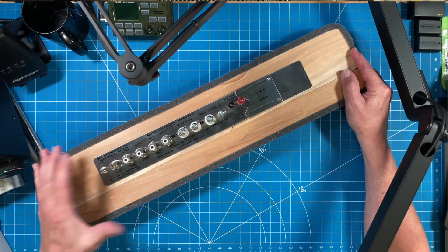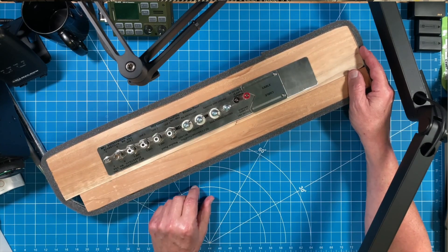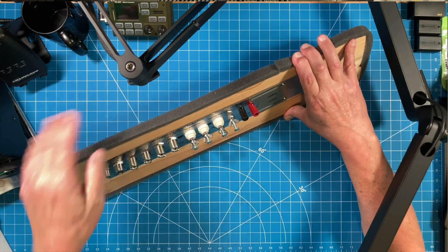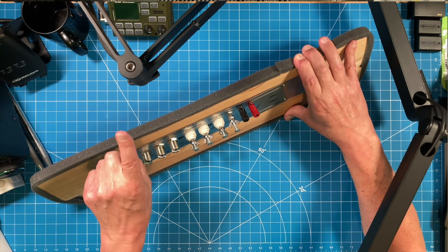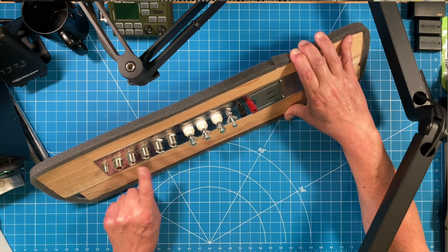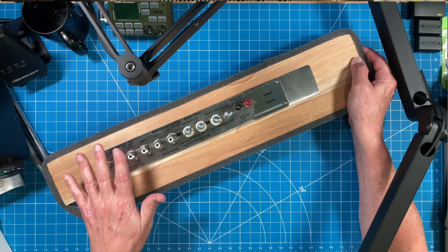This is the weather stripping that came with the MFJ kit. You might need to do some customization — you might need to get some different weather stripping or some caulking. Also, when this is outside and you've got rain beating down on it, it's possible that it could be a leak joint up at the top, and water could seep in. So after you paint, run a bead of silicone caulk right across the top and flatten it out so it looks nice. Take it down the sides, maybe even on the bottom edge, so you don't get any wicking of moisture back up inside. That's what I would do if installing this permanently.